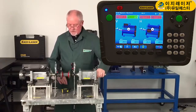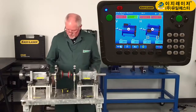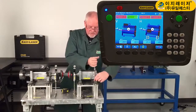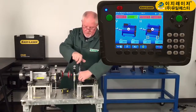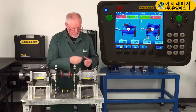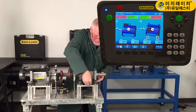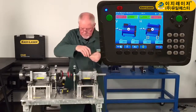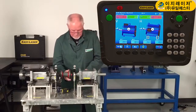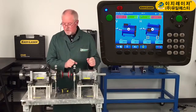I'm going to turn it over so you can see it. It's gone live. I'm going to loosen up my machine. Now I'm going to put the right amount of shim under the feet. I've actually made the corrections for the vertical plane, so now I need to be able to move the horizontal.